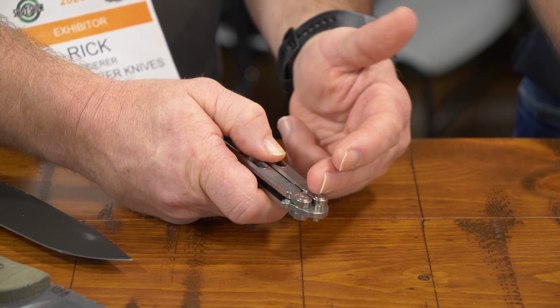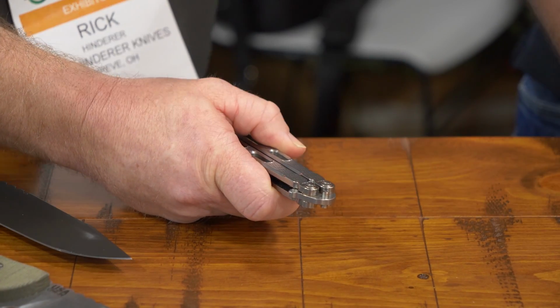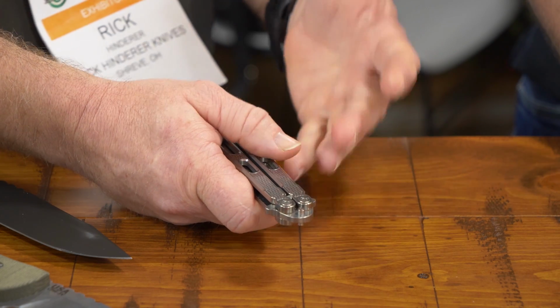I wanted to be better than 1 thou over. So what I'm doing is I'm actually less than a half a thou. So we're talking tenths. I was talking to some people that stopped up to the booth, and they asked, how are you able to do that? Because I have the equipment, I'm able to precision lap and precision grind each bushing in tenths. So when I fit these, I could be a half thou, only 5/10 over, and I'll think, I could do better. So I'll take 2/10 off of that to where there is no movement at all.